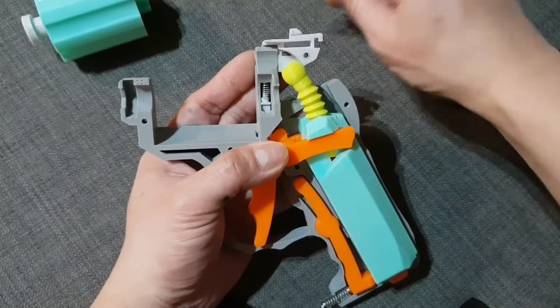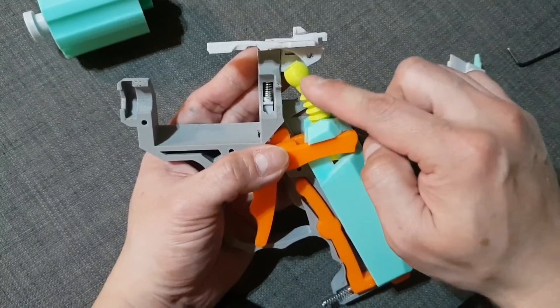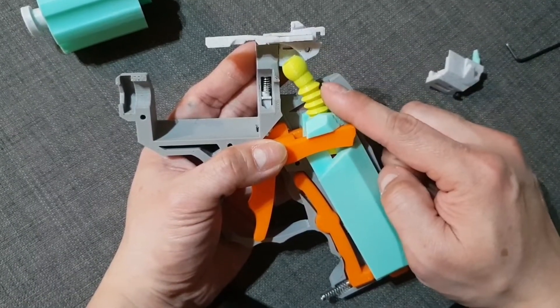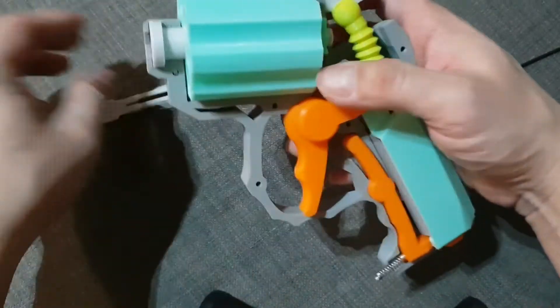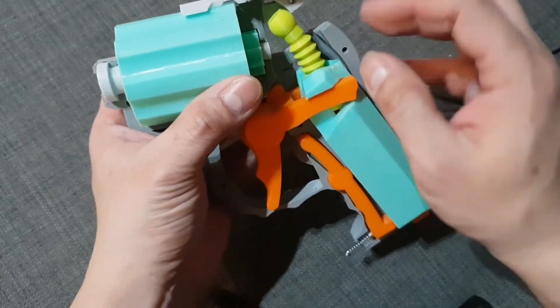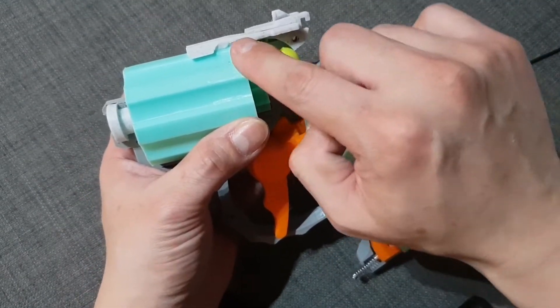The sear will be locking down this until it engages and then unlocks everything, and then the air comes out and fires. So this is the rear side — actually it's not just a rear side. It's a guider to guide this TPU-made nozzle to deform, to bend. And then the bottom of the stopper also acts as a guider to guide this all the way in.